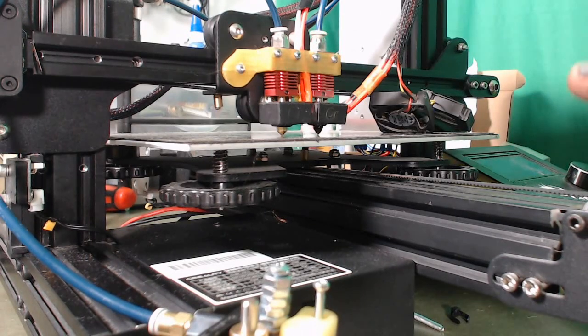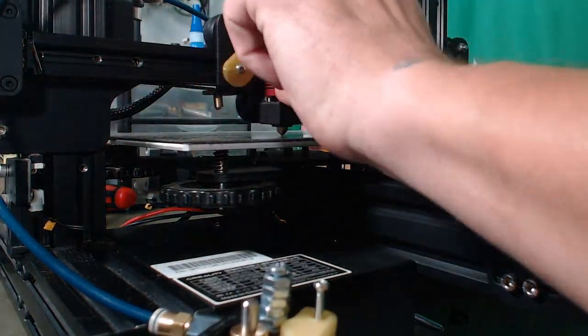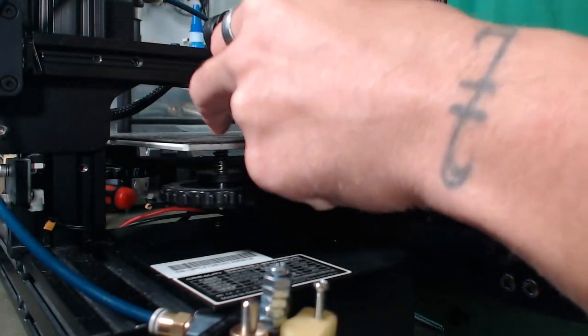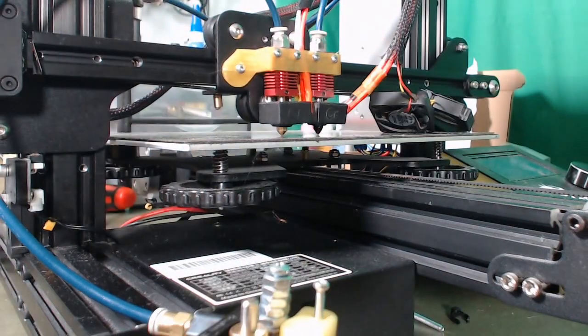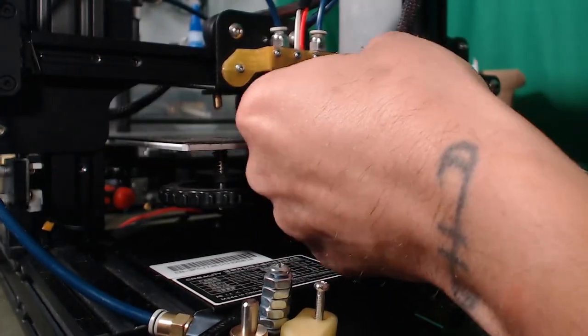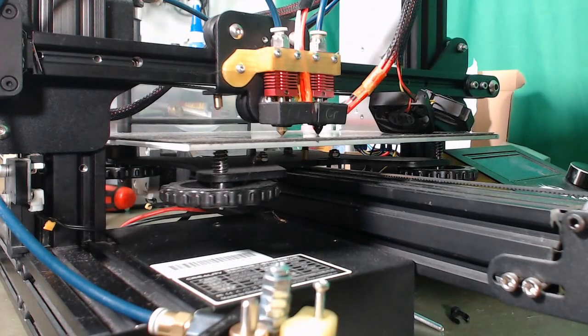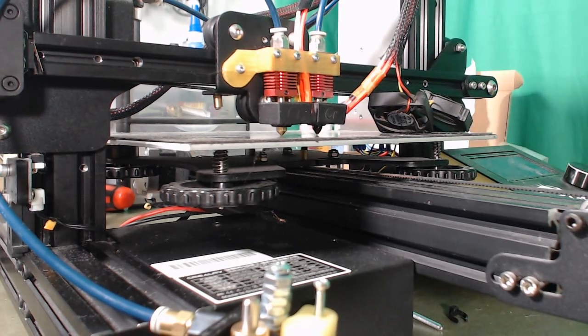When you're leveling your bed and trying to print with two nozzles, that is a big enough difference that I'm going to have to make an adjustment. But the thing is, I haven't done the hot end fix on this particular nozzle yet. We're going to be putting a piece of PTFE in here to ensure that it stops it from jamming, and at that point we will tighten that nozzle up a little bit. The way to do that is to release this tiny screw right here, and that will allow you to turn it up into there a little bit further. It's a minor adjustment, but very necessary in order to get both nozzles printing in the same spot when they travel to each other. So we will deal with that as it comes — it's time to get to work on the next iteration of the mount.